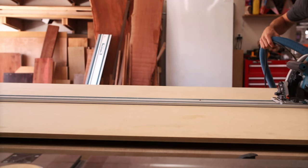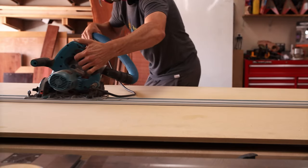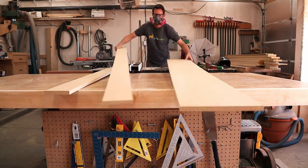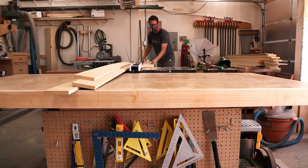Typically, MDF is gonna come in half inch and three quarter inches thick. I'm gonna be making the baseboards to be half inch thick and also the side trim. I also bought a sheet of three quarters and I'll be making some transition blocks and also my headers. For this baseboard, I'm gonna go with a five inch wide — that's what I did in my previous house and it looked pretty good. You can get nine of those strips out of a piece of MDF. You could do all of this with a straight edge and circular saw or a track saw and not even have to go to the table saw if you don't have that. I'm gonna cut it into two pieces that'll get four out of one and five out of the other, offset it, then send those through the table saw — much easier to deal with — and I'll have nine pieces of baseboard.